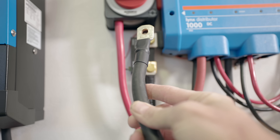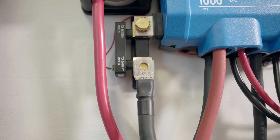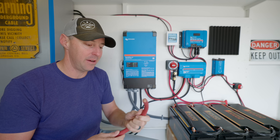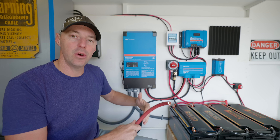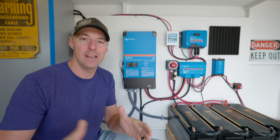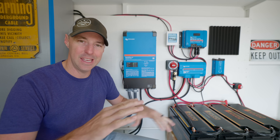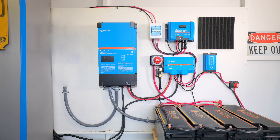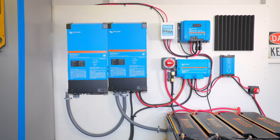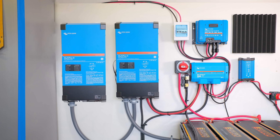I just replaced a couple of wires sized for a single inverter on a 24 volt system and swapped it out for this. Coming off the battery bank, I'd use this 4-aught wire and run to two inverters. If you're on the fence thinking you'd like a 3,000 watt inverter but might want to run two ACs or go bigger later, going with the 24 volt version makes that expansion so much easier.